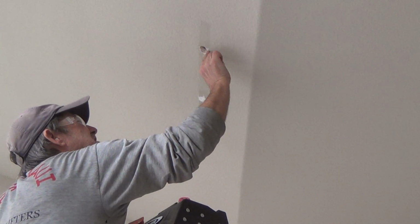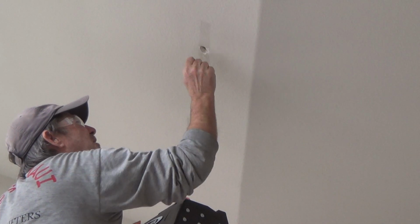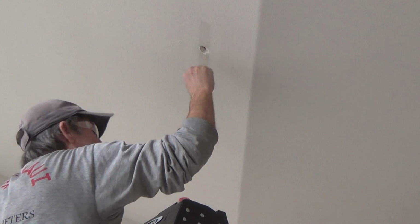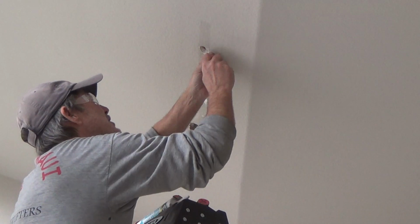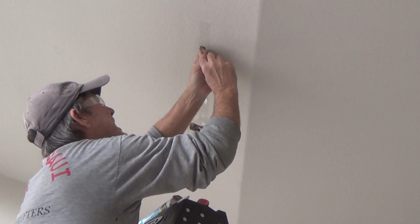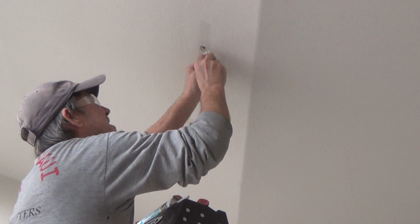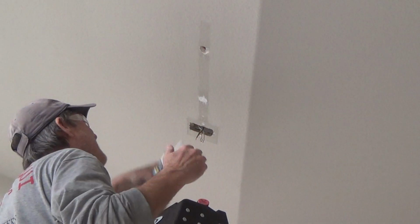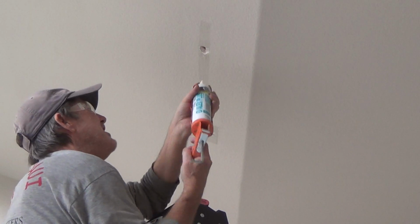Okay? Make sure you got any paper edge. You don't want that sticking out, because that's big enough I can rip it off. If you got just a sheetrock drywall screw for a picture or something that puckers around the hole, you just take a little screwdriver, and any little bit of paper you want to push to the inside, that'll make your little patch easier. I could feel cold air coming through there, coming down here. And that's another reason I'm filling it with caulking.